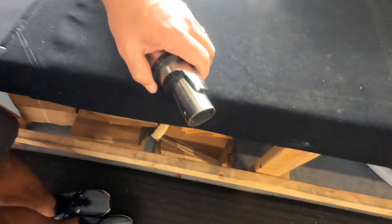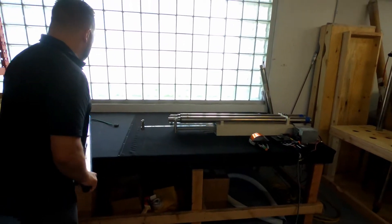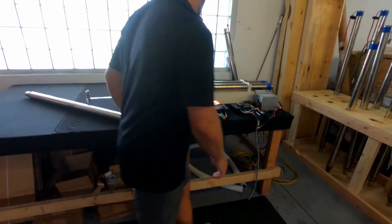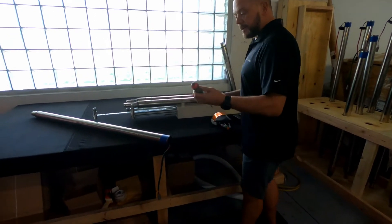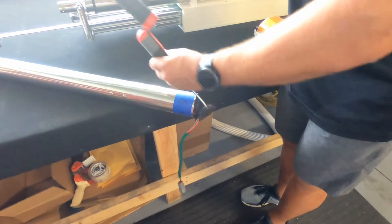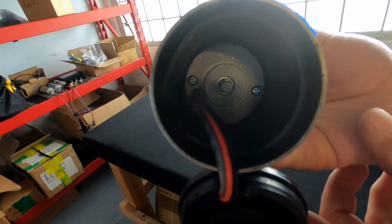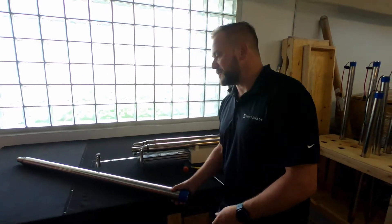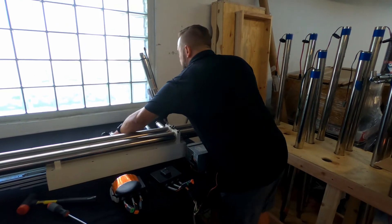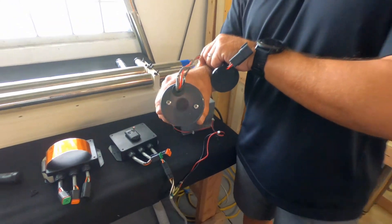So that's how you can tell the difference between Silent Glide and Legacy externally. The last way you can tell the difference is if you have access to the ends of the tubes where the wires come out at the end of the cap. You can take a screwdriver and a hammer, knock the cap off, and if you look inside the end of the tube, that's a Legacy motor drive shaft. And if you do the same thing here, that's a Silent Glide motor.